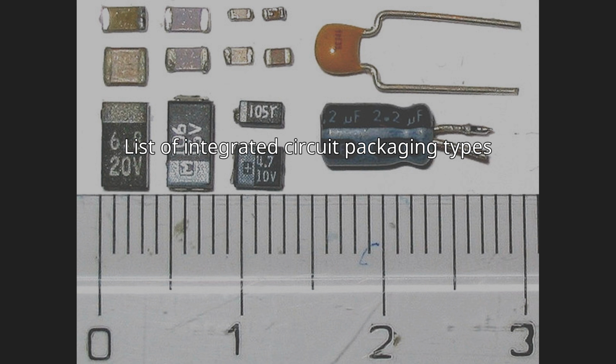In flip chip systems, the IC is connected by solder bumps to a substrate. In beam lead technology, the metallized pads that would be used for wire bonding connections in a conventional chip are thickened and extended to allow external connections to the circuit. Assemblies using bare chips have additional packaging or filling with epoxy to protect the devices from moisture.